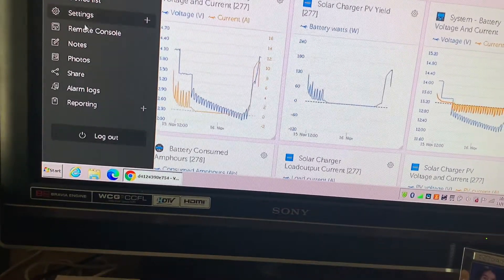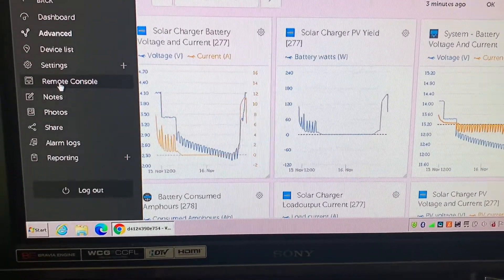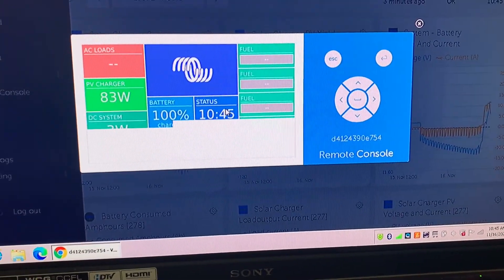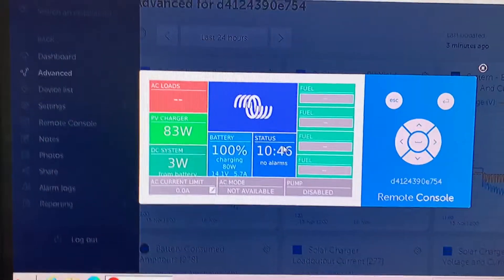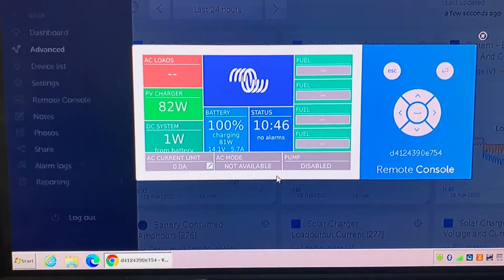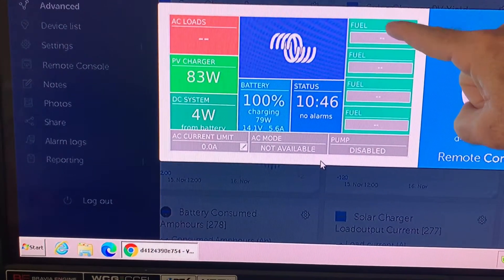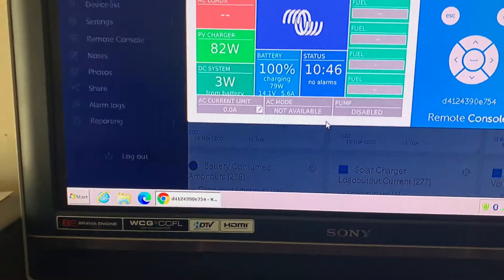But there's another view here — and this is where, if you had bought a separate GX display device, I'm saying you don't need to. Because if you click on Remote Console, what we're going to see is the same view as if you had one of those GX devices. You have three different views of this. These are my gauges — that's another big benefit of the Cerbo GX. I can plug in fuel, water, gray water, whatever I want. There are tank monitors built into the Cerbo GX.